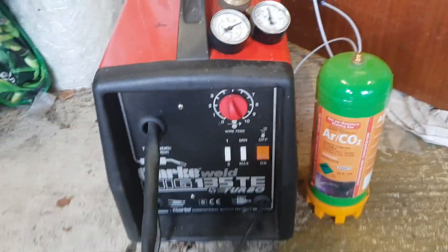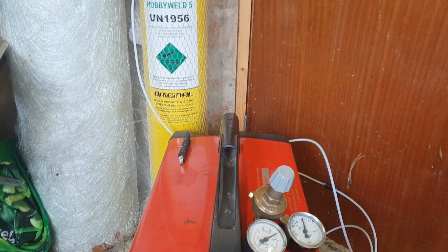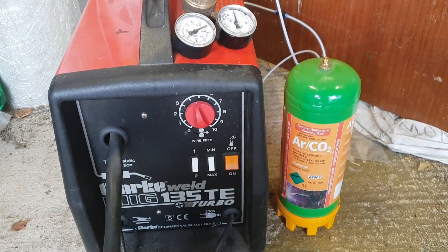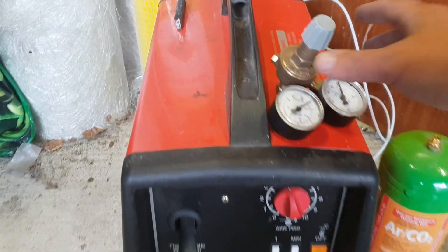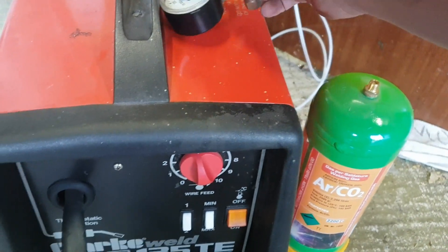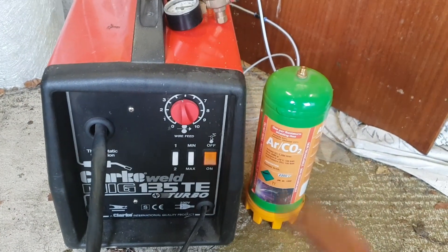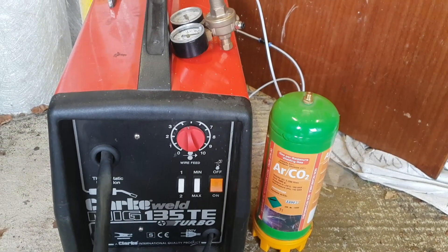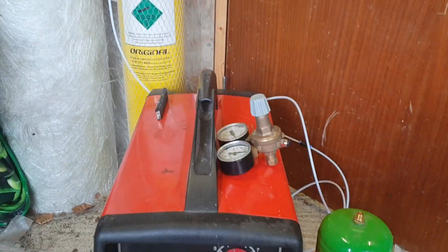In this video I'm going to talk about the HobbyWeld gas - the larger bottles over there - rather than these smaller 2.2 liters or the even smaller disposable ones. The smaller ones have the advantage of fitting the standard gas regulator that comes with all these hobby-type MIG gas welders. I think SIP and Clarke and all that lot do roughly the same ones. It's actually really easy to convert over to use the bigger bottles, which are much better value, so I'll quickly show you how that's done.